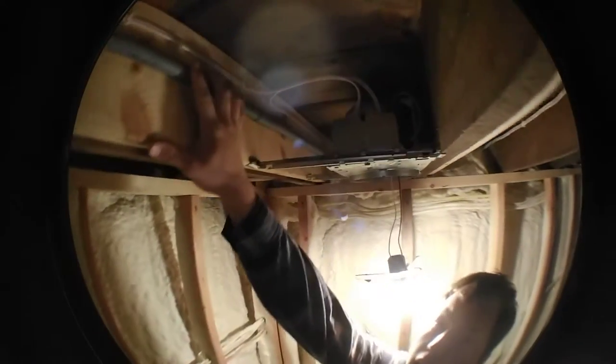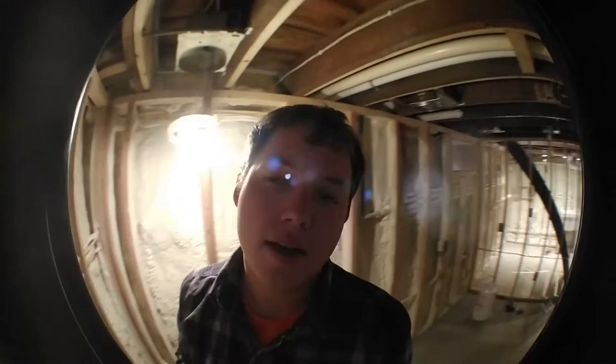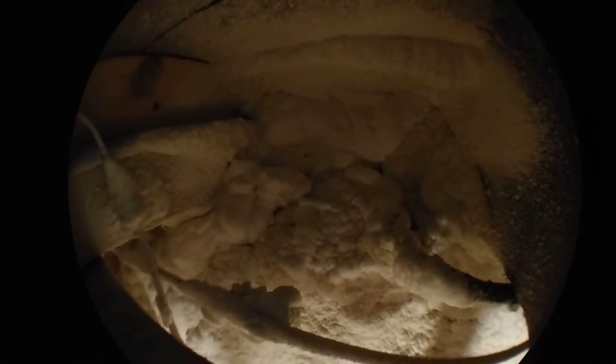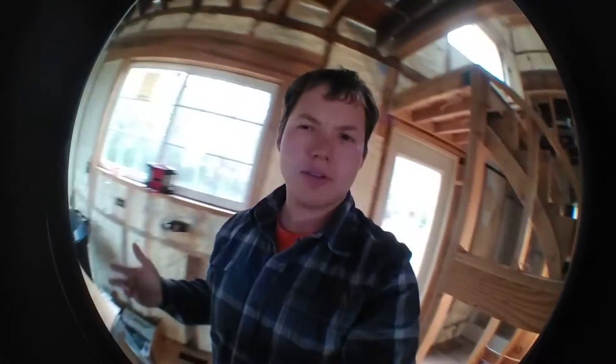This conduit right here is just a piece of half-inch PVC conduit that goes to the outside — I'm anticipating possibly bringing in the internet through it. It's a lot easier to do that rather than try to get your pipe through all that spray foam. It's not difficult to drill through it, it's difficult to know what's in all that foam. So it's nice to have a piece of conduit in there beforehand. If you are anticipating anything, or even just want to future-proof a little bit, go ahead and put an extra conduit or two through.